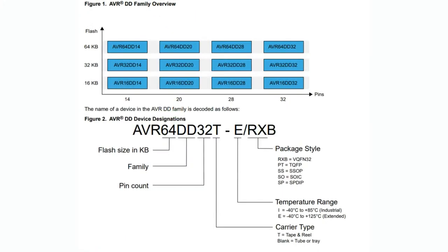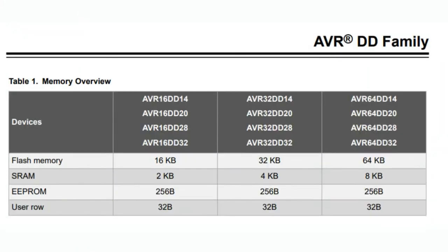There's a bunch in this family. What I do like is that Microchip has done a very standardized way of pin count, flash, and memory. They made a grid where you can get any config — you'll get more timers when you have more pins, and there are two underlying dies. You pick your number of pins, then you pick the amount of flash. You're mostly paying for flash memory, and SRAM increases with it. Not all variants are in stock or released yet. Basically you double the flash, you double the RAM; EEPROM and NVM stay the same.